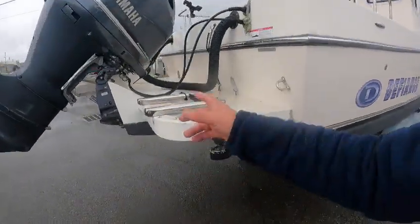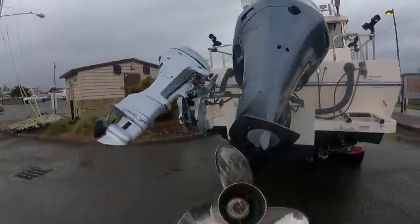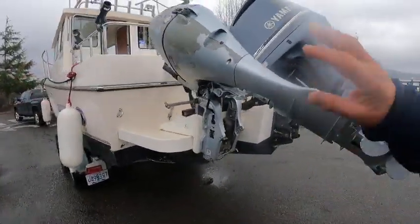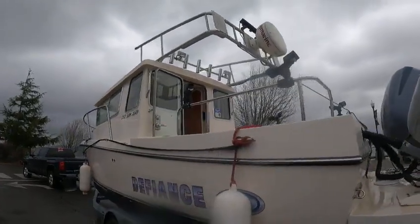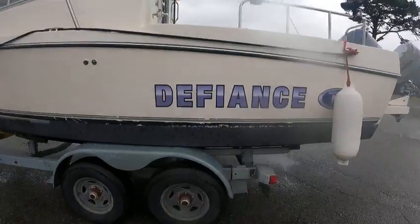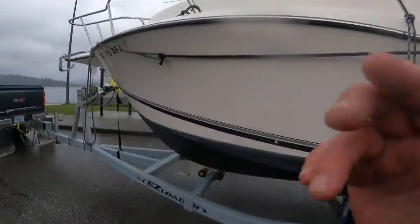We'll go through all the inside once the boat's in the water — just easier. Got your ladder right here. Got some paint missing off of here. Got internal zincs. Some paint missing off the kicker. The license stuff works. Couldn't find the lid for your bait box. Gear oil looks good, so we'll give her a whirl. Boat doctor out.